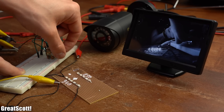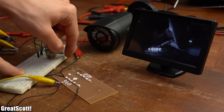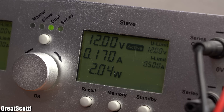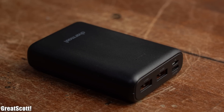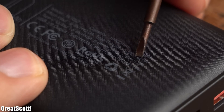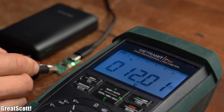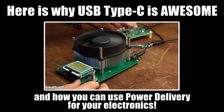Next I had to think about a portable power source. The LEDs with driver and 555 timer circuit require a maximum of around 250mA, and the camera with screen around 350mA at 12V. A USB Type-C PD power bank with an output voltage of 12V and a maximum current of 1.5A would be a good fit. Luckily I also had a suitable USB Type-C PD driver PCB available. If you want to know more about USB Type-C and this driver PCB, make sure to watch the video I produced about that topic.